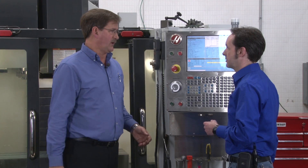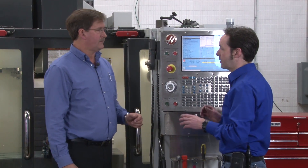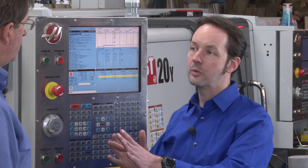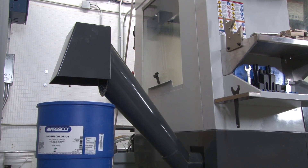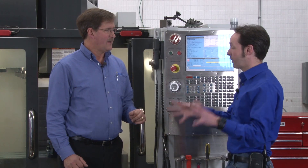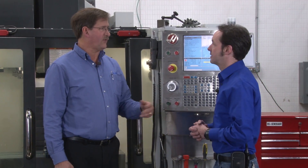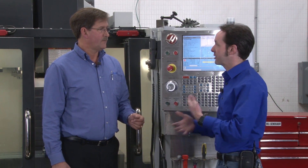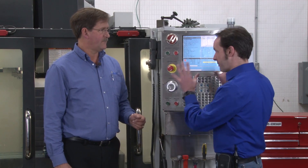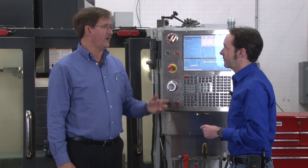You've got to push all these chips out of the machine, so it's better to have a constant light stream. Where do the chips go? They go down to the end and out of a chute — you need something to catch them or they'll just dump on the floor. Most shops have a variety of containers: one for aluminum, one for steel, one for brass. Chips get recycled and there's money there — most of today's steel is recycled material.